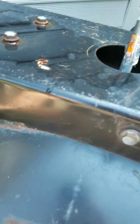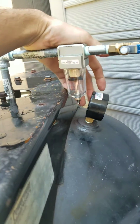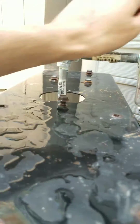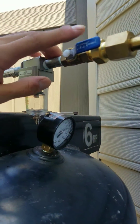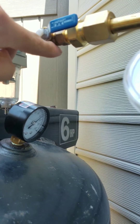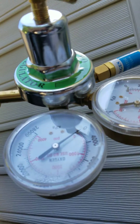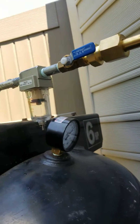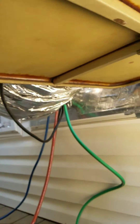Just a fan to keep everything cold. Coming out to here, another ball valve going into the tank and out through the top — an elbow, not a tee — and this is just an air filter. I don't think it's necessary, but since this tank is kind of old, just to be safe. Another pressure gauge, another ball valve, and then you've got your MPT-to-CGA fitting right here — that's the key thing you need for this system, so you're able to hook up an oxygen regulator threading into national pipe threading. Then it goes straight inside to the bottom of the ducting.